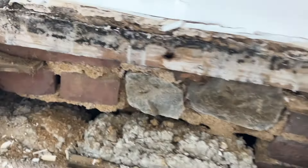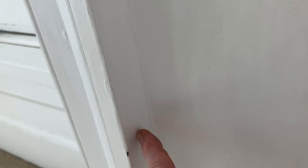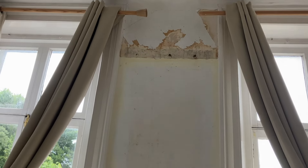It's probably dry in there, which is surprising. If we measure off the wall, we've got 40 mil before we get to the end of the architrave — the thermal board is 27 mil, so that'll work out fine. I'll just have to cut it neat, keep it tight, run it up the wall. That's not a damp patch — that's where the previous tenant touched up the paint with a different color. There are patches of it everywhere — I thought it was random damp coming through but it's not, it's just different-color paint.